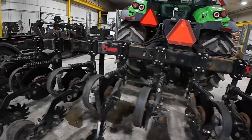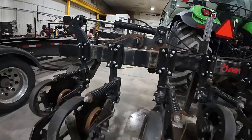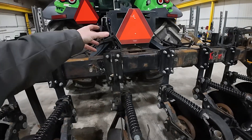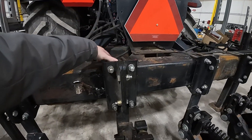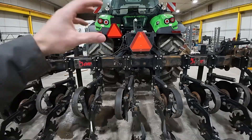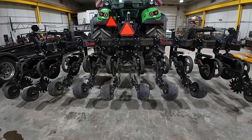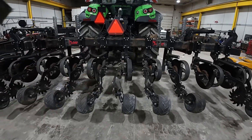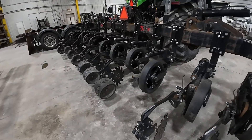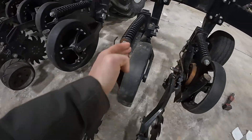That's what we're building on this particular bar. It's a Demco three-point, obviously hydraulic fold bar, and he's going to hook a cart with our FE4R tank up here to the toolbar. It's going to be a gooseneck hitch-style trailing two-wheeled steerable cart that he's going to hold all the chicken litter in, and we're going to run hoses down to each row.